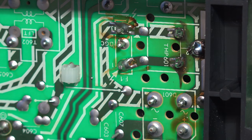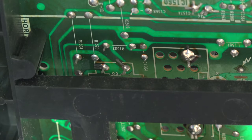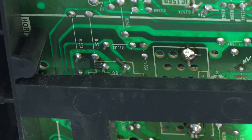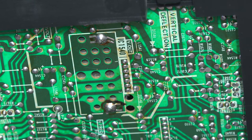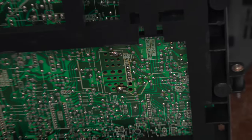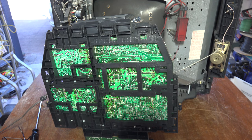While I'm at it, I'm also going to inspect the horizontal drive transformer connections because they were problematic. What would happen is the connection would crack and you would lose horizontal drive, which would blow the output transistor. This is the horizontal drive transformer right down here, and looks like the connections are okay on it. Connections that are worth inspecting and re-soldering if necessary is the vertical output IC right here. If you see any cracks around them, do re-solder them too, otherwise you could have a vertical problem. Other than that, these TVs are actually quite reliable and don't give a lot of problems — that's why these sets have lasted as long as they have, because they were well built.